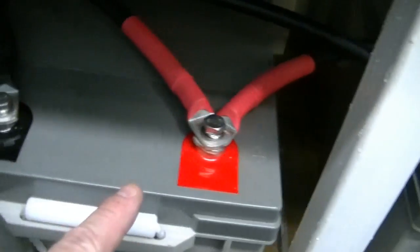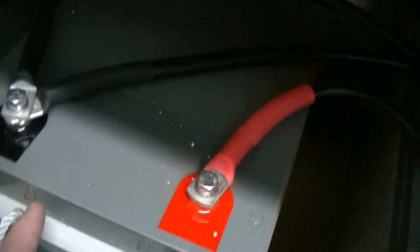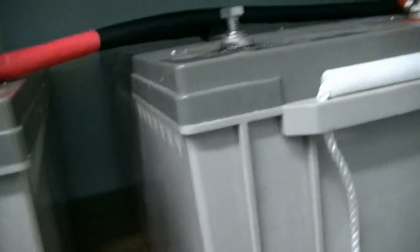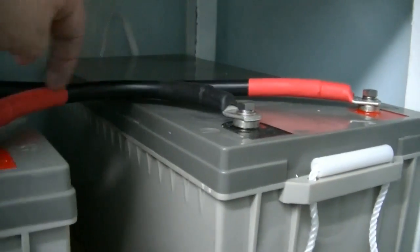We're in the battery room. I'm just disconnecting the leads, ready to change the wiring a bit. So basically we used to have two batteries linked as one battery — two batteries together to make 24 volts. Now we're going to take the wires off these two and put another link from that one to that one. Basically instead of having two batteries together, we're going to have one, two, three, four batteries in series, which will make 48 volts.